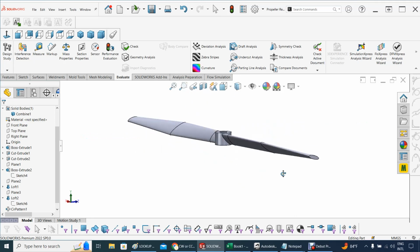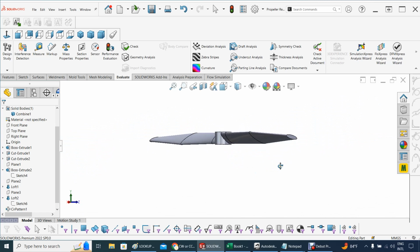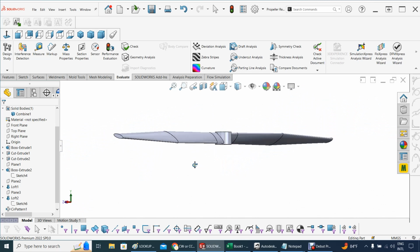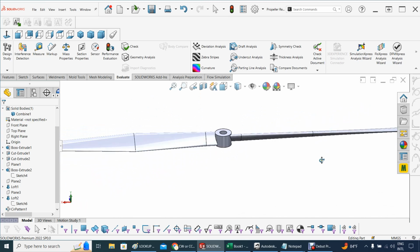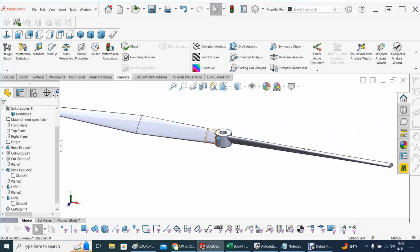And one important thing is, depending on what motor you are using, this blade needs to be set to turn clockwise. So that's what this looks like. It's going to be set clockwise. So if the propeller is turning this way, as shown, clockwise, then the nuts that sit here, fixing the propeller to the motor, need to be counterclockwise. So it will lock itself, because the propeller is turning this way, and the nut will need to be counterclockwise.